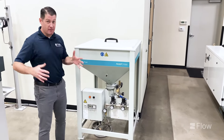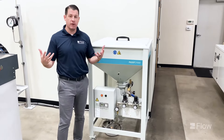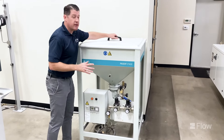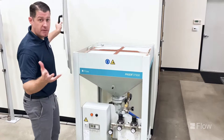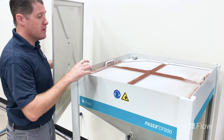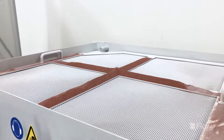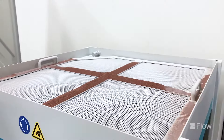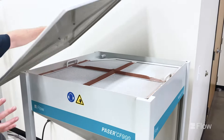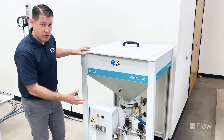We're here at the main next component on the waterjet — the abrasive pump. This is where you load the abrasive or garnet sand into the machine. Easily accessed, you take your 55 pound bags or larger super sacks and dump them right in. There's an integrated mesh screen that prevents anything from getting out to the mini hopper. With this design, you can fit up to 900 pounds of abrasive sand, easily accessed and tied right into the main machine.